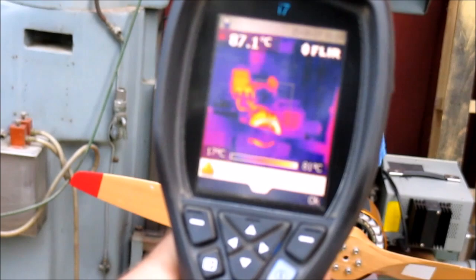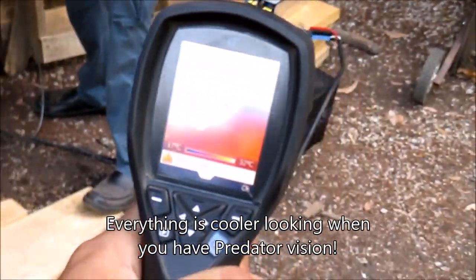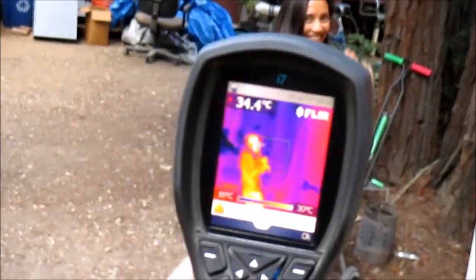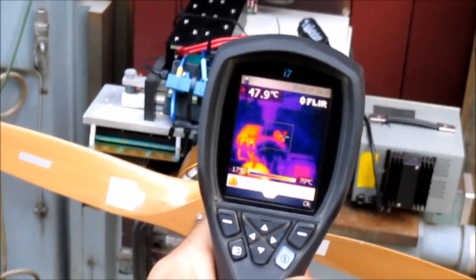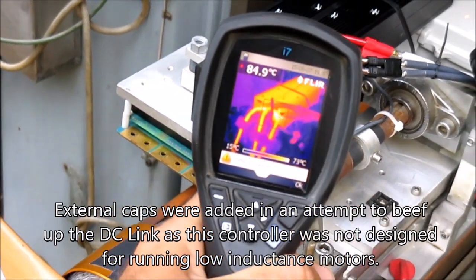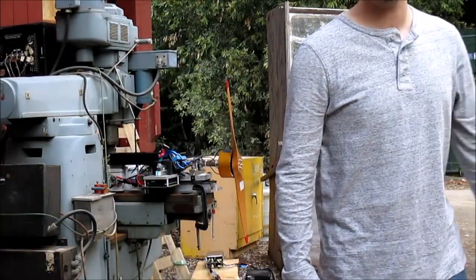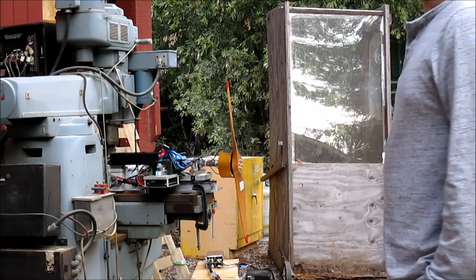This is finally cool looking — it's like cool out. The motor and the inverter are clearly hot. We ran that for a minute at 12.5 kilowatts, 120 amps DC on a 100 volt bus. We started off at 50°C on the MOSFET case. Caps are warm too — up at 50. The ambient temp in the case right now is 46 degrees. So freaking happy — 12.5 kilowatts. We were able to rip the throttle up and down several times without losing tracking.